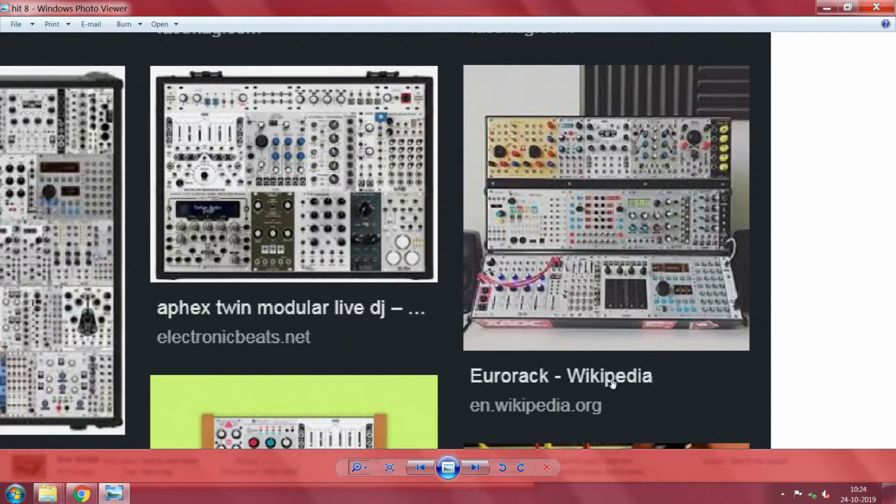to the extent that just a little while back I talked to you about the 19 inch or the rack mounted thing. So, if you go to wiki and check for what is called the Euro style rack, this is a multiple of a U. 1 U is 1.75 inch, which will come to a very odd figure of some 44.45 millimeters. These are all pitches in step repetition, and you can always make a library of these things and keep. Whenever you want, you can cut and paste them here.